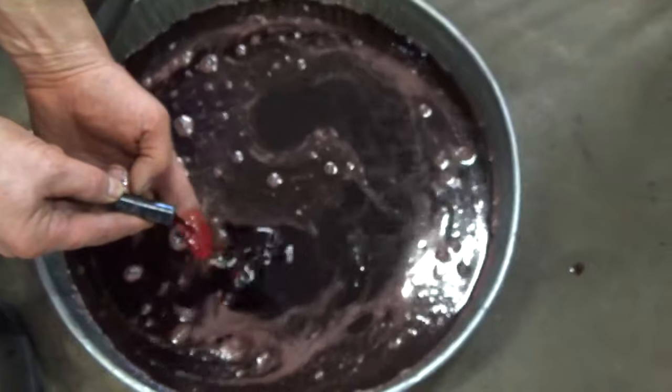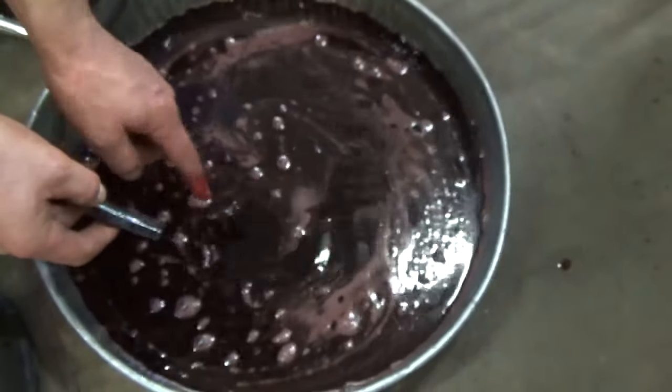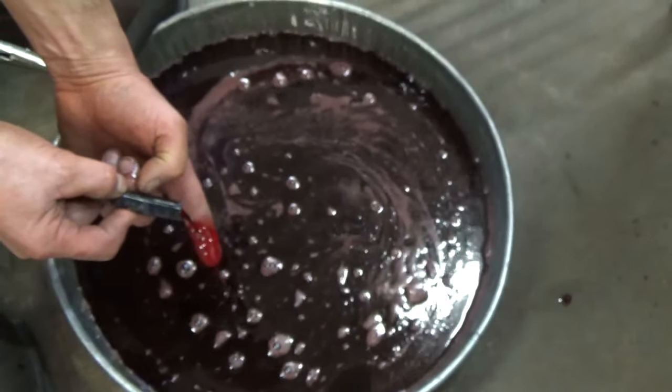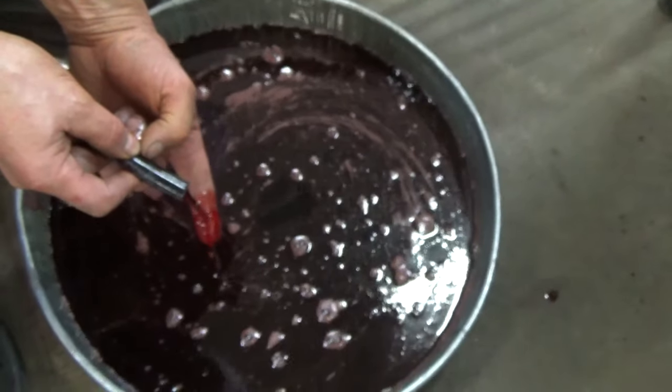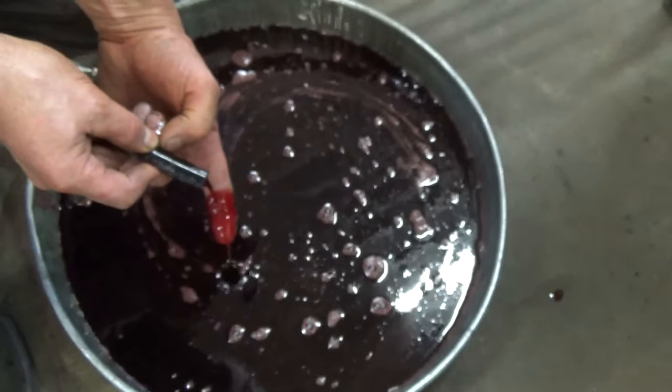What we'll do now is we'll hook up our cooler lines, put those back on, and then we'll top off the transmission, start it up, and recheck the fluid level. But yeah, we're getting a good nice cherry red color out of it there. So I'm pretty happy we got a good majority of that old fluid out, torque converter and all that. So all right.